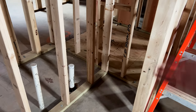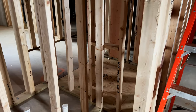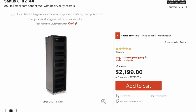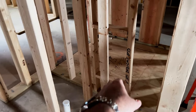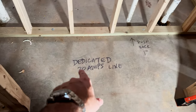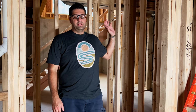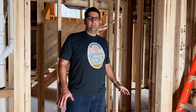This is where the rack's going to go. I'm going to have a wide rack on casters buried in here — thinking about an 80-inch rack. As far as power, we decided on a dedicated 30-amp circuit for this entire closet room. This rack is going to power not only the home theater but also a whole Control 4 system, several receivers, the rec room on this floor, the family room upstairs, the master bedroom upstairs, and a full home audio system. It's going to be a combination of networking and amplification for the entire house.